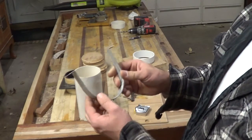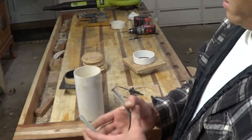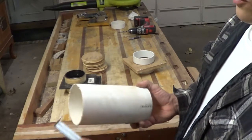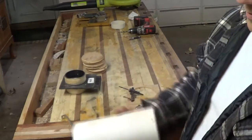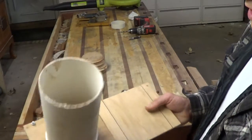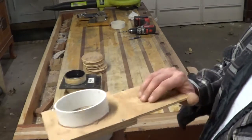I think these couplers might have been from a woodworker's store — actual dust collection pipe, not from Home Depot or Lowe's. But these are exactly four-inch, so that'll give you a good clamp surface. I think they're just called four-inch dust collection clamps. These are good for when you're going against walls and have to mount your pipe. Your four-inch coupler and four-inch pipe fits right in there. You've got to gap it out a little bit wider — I used a business card, cut it with a razor blade, and that gives a little bit thicker clearance so the gate rides smooth.